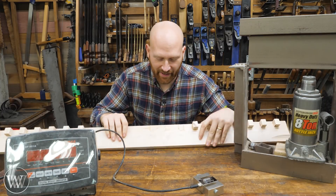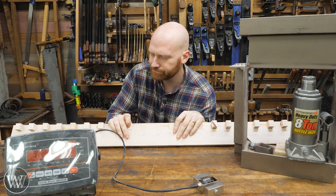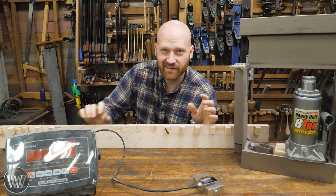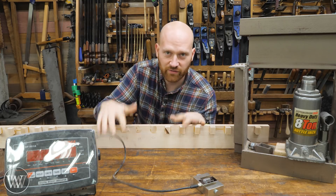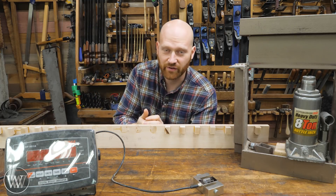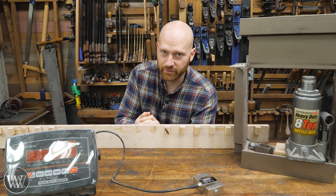One year done — and I was actually kind of surprised to see some of these glues slightly improving in performance, which was interesting and unexpected. But the super glue dropping off wasn't surprising, because it is a more brittle connection, especially with expansion and contraction. All of this wood is out in the garage with no air conditioning, so it's exposed to maximum expansion and contraction — down to freezing in winter, well over 100°F in summer, plus humidity swings.